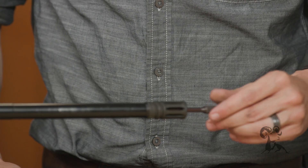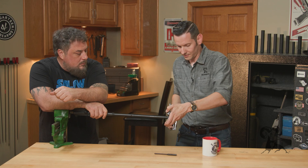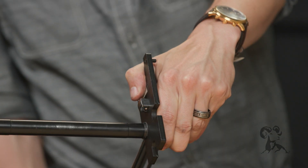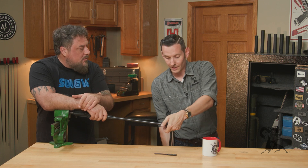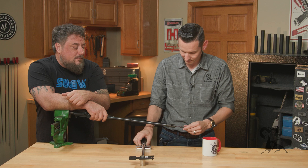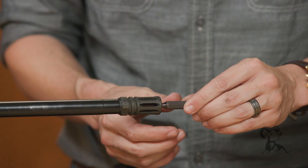Let's see if this holds true. It's a little stiffer — I'm going to go a little bit further with it. Basically all that rotation was the crush washer flattening. Now we're just going to pretend we're frustrated timing our muzzle device and we just want to be at the range. I'm overdoing it because I'm 165 pounds — most people are a little heavier than me. Remember, on this particular example the crush washer is absorbing some of that torque. A lot of times on a suppressor host or a muzzle brake, you're mounting that directly to the barrel without a crush washer, so you wouldn't have that cushion there. It was going in freely and now I can still get it in there but I have to twist and force it — it's obviously more constricted.